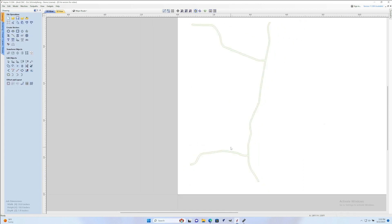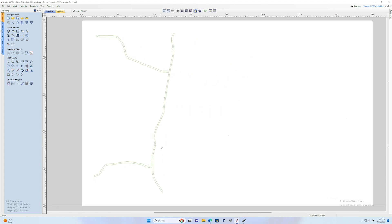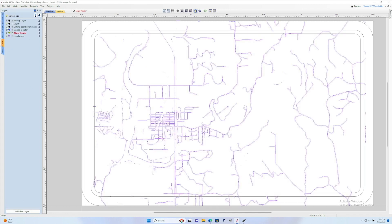Now even though all of these vectors are now closed, we need to weld them together. To do that I'm going to go up to the Edit menu, then press Selection, and then Select All Vectors — you could also use Ctrl+A for this. With those vectors selected, I'll go to the Join tool. It's reporting that some of the selected vectors are open, but after I press Join I'm going to have zero open ones, which is what I want. So now these vectors are all prepped and ready for toolpathing, but we've got to go clean up the rest of the vectors we have.